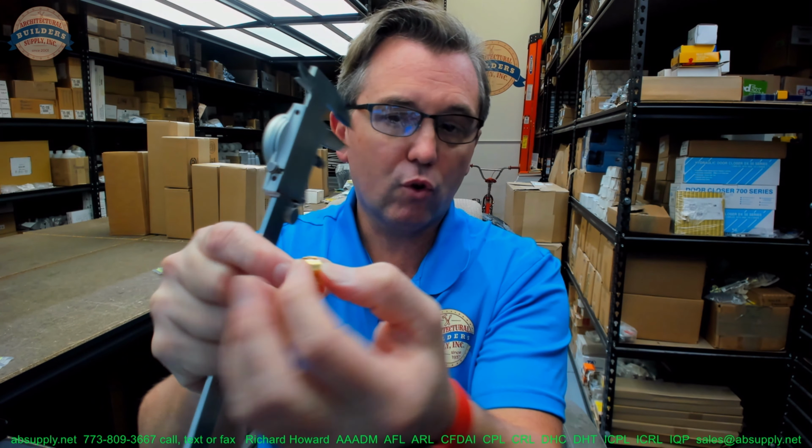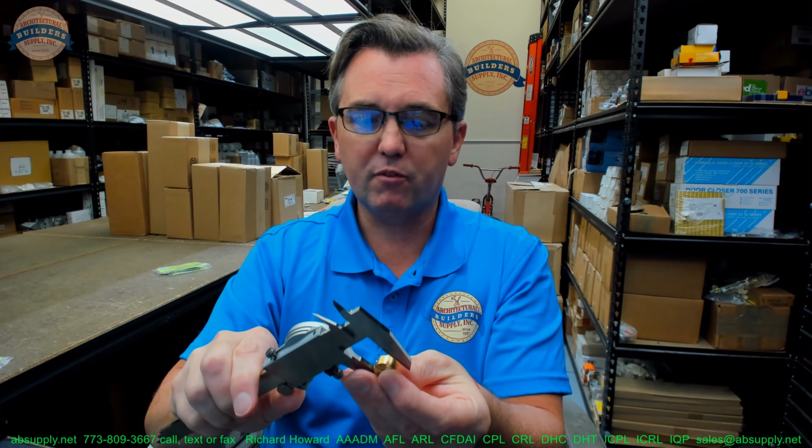Now let's take some dimensional properties of our drive cam. The drive cams are always going to be the same size because the components that you get in each extension will change, so there's only one size of drive cam, but then there are 10 different drive cams. The overall thickness is 0.287. 0.287 overall thickness, just providing this for the sake of providing it.